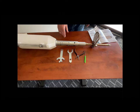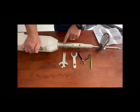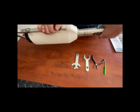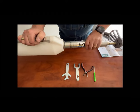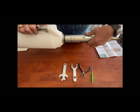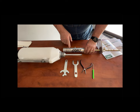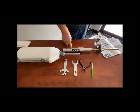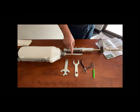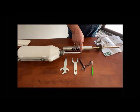We're going to start by taking off the sleeve from the tank. You do that simply by holding onto the tank and twisting this sleeve here to free it up from the threads. Once it's free of the threads, you simply pull it apart. Now we have the sleeve — that's number 12 in the instruction guide — and the piston, which is number 9 in the instruction guide.